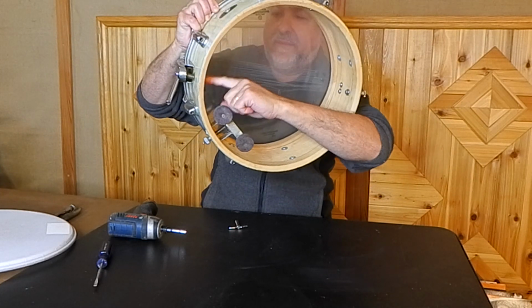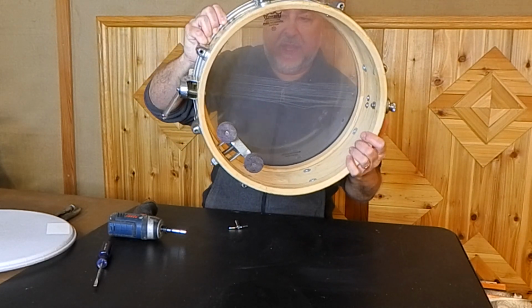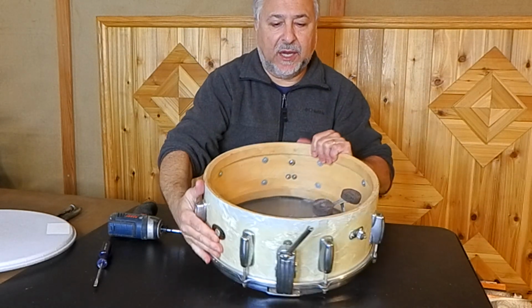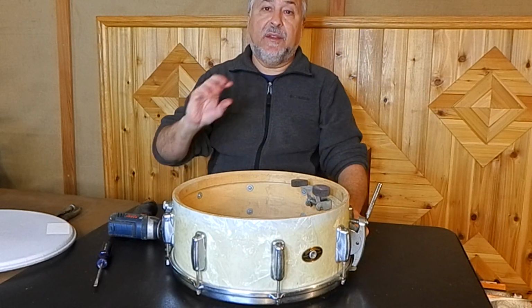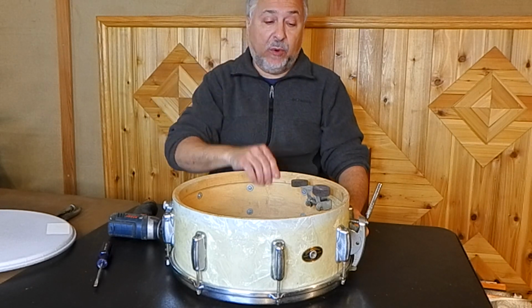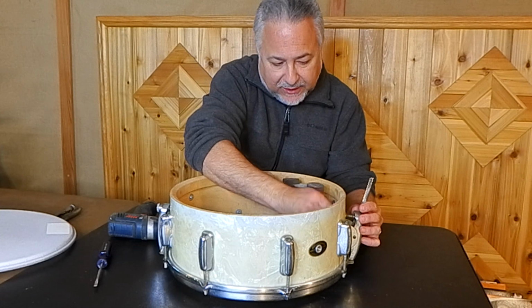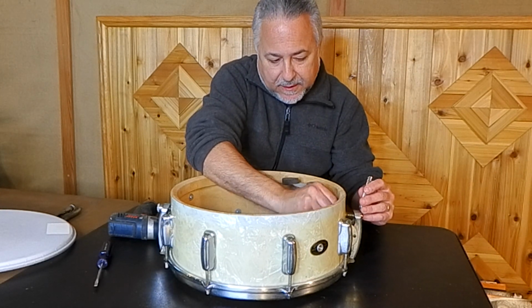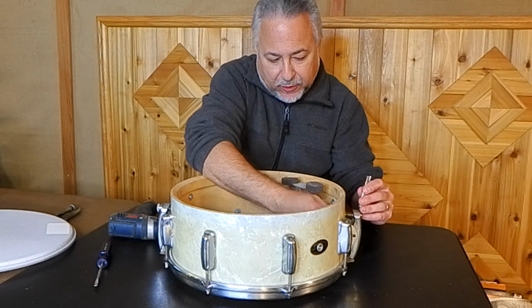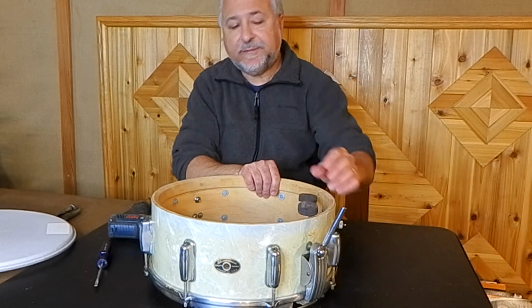This bolt there. That's what comes loose. Okay, always. So you can put a lock nut on there. A lock nut's going to have some plastic in it, and then when you tighten it, it won't come loose, and then a washer. So that's what you can do. But in the meantime, what you need to do is tighten that thing up so you got some tension back on it. And then you can put your lock nut on there. See? So now it's not wiggling anymore.